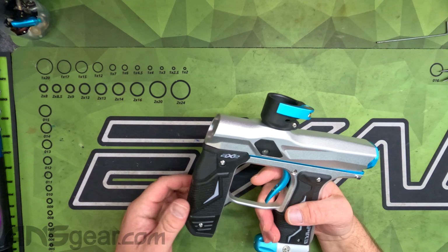And it's changing the position of this pin right here. It's allowing this pin to move because you're pushing against this. By adjusting how much you're pushing on this spring, you're controlling where this piston can and can't go, and you're controlling how this thing can regulate pressure. So this little puck is very important right there. If you ever have a reg issue, not a leak, but a pressure issue, that's usually the culprit, and you want to look into that.